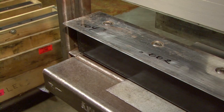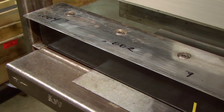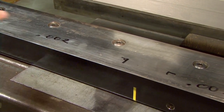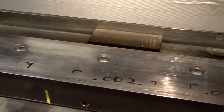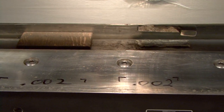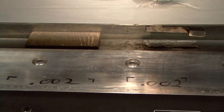Now we're showing the markings where the blade was out at room temperature. It's two thou from this area to here, two thou from this area to here, and two thou from there to there. That would cause the ice to be uneven and definitely cause the curling stones to run rather than curl properly.